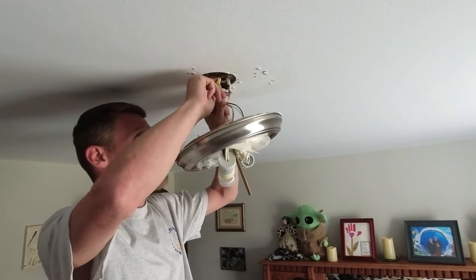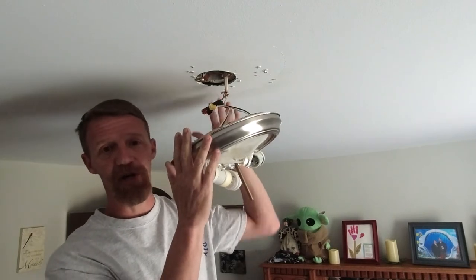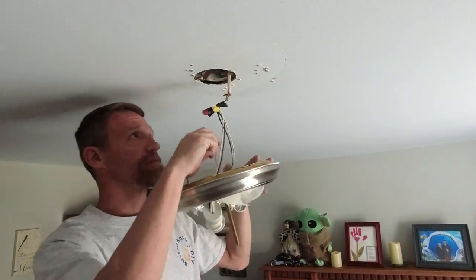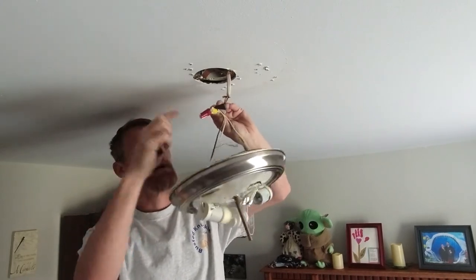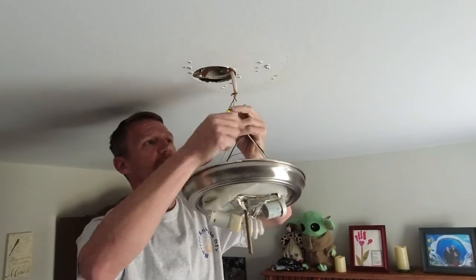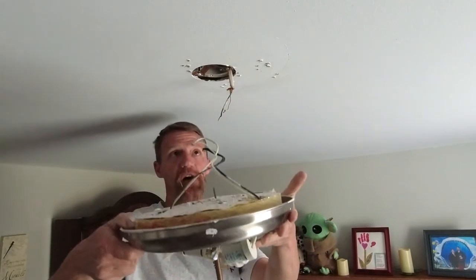Basic electrical safety here, guys. I would recommend to anybody that hasn't done a great deal of electrical work to go ahead and kill your breaker now. Understand this is a light fixture — there's no power going to it at all with the switch in the off position, which we have. So we're gonna go ahead and unwire it. We have this bare copper wire, which is our ground. They've taped up these other leads. The black lead, in household electrical, is your hot lead — the one carrying the current. And the white lead is your neutral. Just to make double sure, if you don't turn the breaker off, don't touch any couple of these at the same time, and you shouldn't get shocked. Anyway, the light is down.